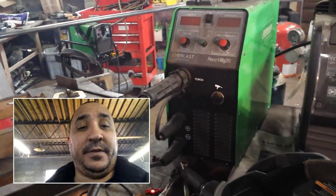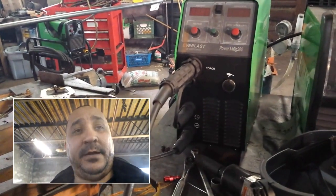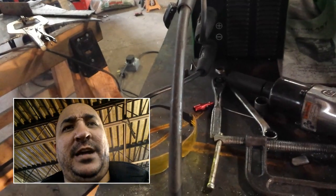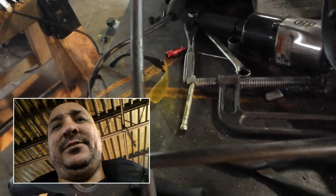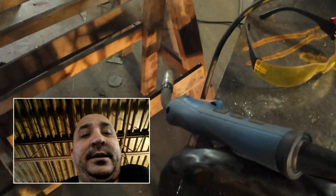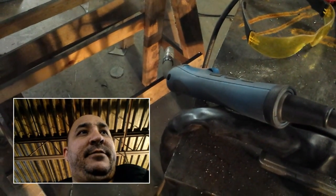It's a sleeve-type bushing in the fan and it starts having issues, but as soon as it warms up it's fine. I thought about putting halogen lights next to it but it was late so I called it a wrap. I was also having wire speed issues — a lot of spatter, spitting and sputtering. Came back this morning, checked the tip, and found a piece of metal wedged into the hole, causing the wire to burn inside the nozzle instead of at the weld. Changed that out and everything's good to go.